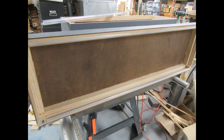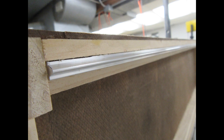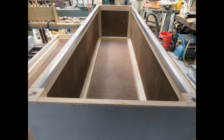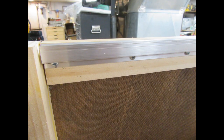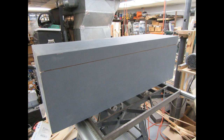Here are a few photos showing the valence strips attached to the case — just little sheet metal screws going into the reinforcing wood strips. I orient the valence strip half that has the extended wedge part on the top, and the bottom part has the trough that aligns with the top. Here after the valence strips are added, I put the top of the case back on to check for good fit. One side lined up and the other side had a bit of a gap. I actually had to fix that by lowering the valence strip — I had put it on just a little too high. That required drilling new holes in the valence strip because I couldn't move it that small amount and still have the screw holes line up.